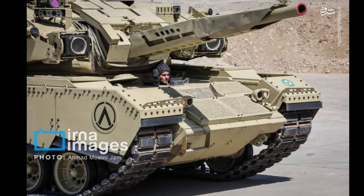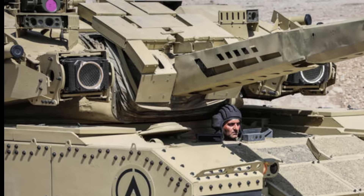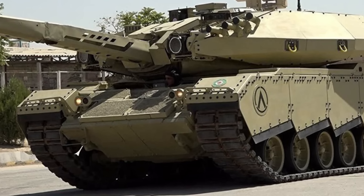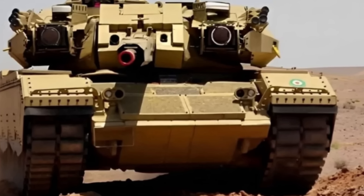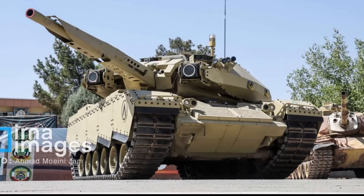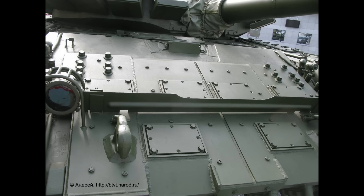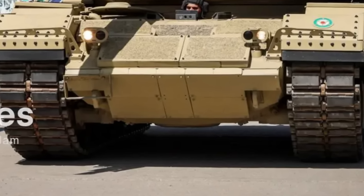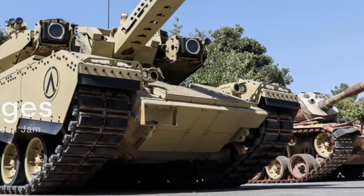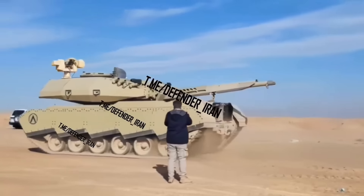There is explosive reactive armor mounted on the turret front, except it is placed on a very small area because the dazzlers are taking up a lot of space on the turret. The hull also appears to have some form of extra protection. It is not completely clear if this is composite armor or explosive reactive armor, but it seems like ERA — under the external plate with the anti-slip coating there appear to be several panels, most likely done in a similar fashion to Contact-5 on the T-72 and T-90 tanks: several explosive panels under a larger steel plate. The lower front plate of the hull is also equipped with what appears to be ERA. It is not clear exactly what ERA it is or how much protection it offers, but judging by its dimensions and the budget nature of this upgrade, it's probably meant to protect against standard RPG rockets and older ATGMs.